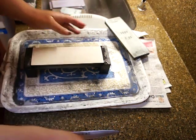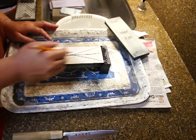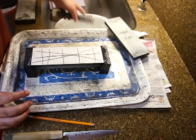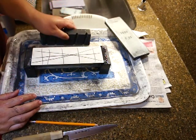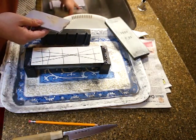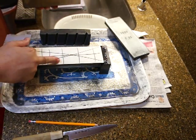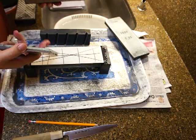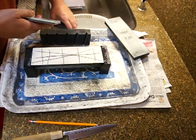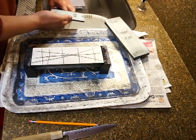At the beginning, make sure the stone is flat. Use a pencil and draw lines on it, then use a flattening stone or a rougher stone. Since the main stone is 500, you must use a lower grit — this is a 220. Anyone can use it; I use this one.